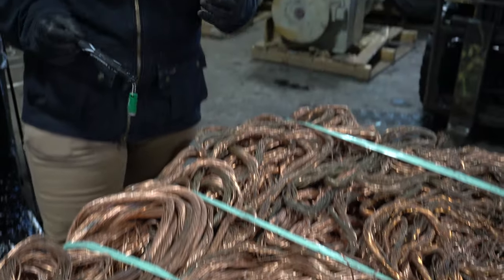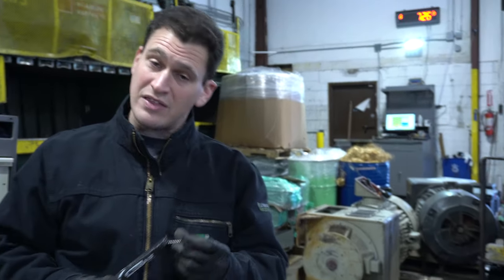Now when you're out there scrapping and you're looking for tips and tricks, having that magnet with you is always one of the most important things that you can do. It gives you the ability to know if you have steel or if you have copper, aluminum or steel, because this magnet is going to be one of, if not your best friend when it comes to scrapping. One of the things we always hear from different scrap yard owners is they tell their yard employees to have a magnet on them at all times.